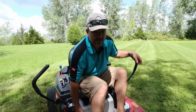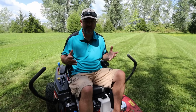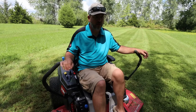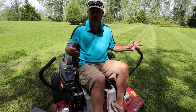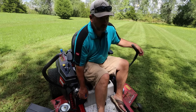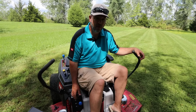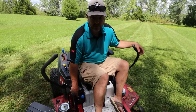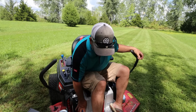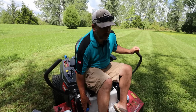So right here on the Smart Speed system, I mow on turtle just because I like to take my time. My yard is not completely flat. So if I was going on the rabbit mode, 7 miles an hour running through my yard, it is quite bouncy. So when I'm mowing, I keep it on turtle. They call the middle one the towing mode, actually. The turtle one's just for going slow or for newbies. You can put it down into top gear, and that will give you your full 7 miles an hour.